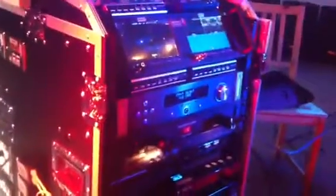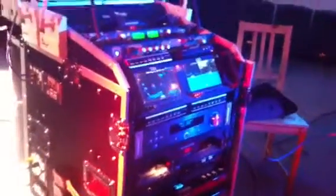Our third input are for our video cameras. Over here, pre-wired to the side of the case, are our 4 video cameras, and that allows you to take the cameras either through the wireless transmitters or through the wired video cables, and those video inputs are split to the monitor, allowing you to see all 4 cameras independently in the monitor, and then they also go to a 4-camera switcher down here, which is sent into channel 3 on the receiver. That allows you to see all 4 cameras in any combination independently from the monitoring, so you're able to kind of cue and play and do the cameras as you like.